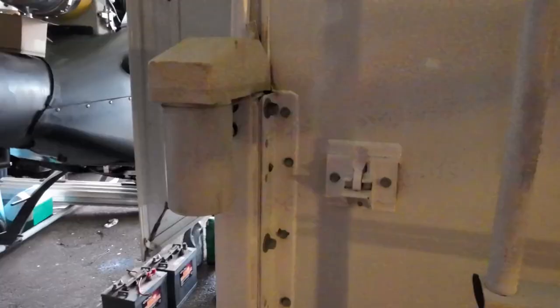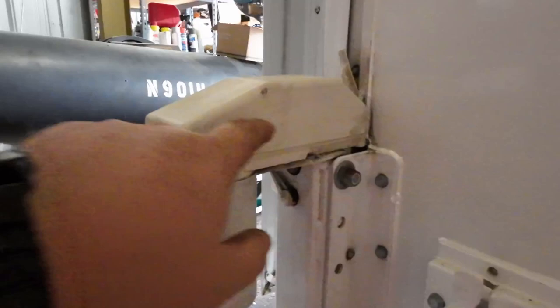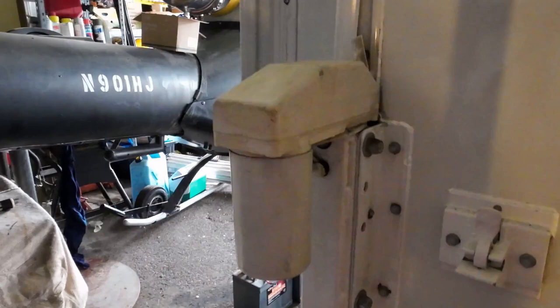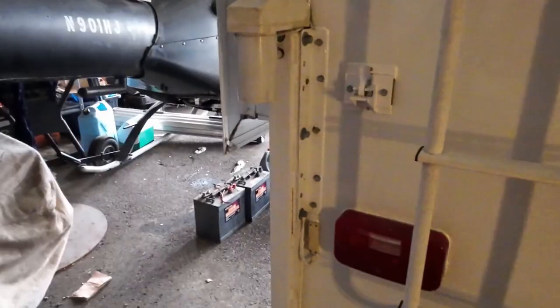I talked to Happy Jack and they think it could be a brass bushing up in here — this motor drives a gear. I'm going to be taking this off. I have some new thrust bearings, some needle thrust bearings, and a washer for in there. We'll see if it's this brass bushing; I don't know what the part number is for that. It may just need to be lubricated. We'll check its clearances and see if it's still good, but let's get this jack off and take it over to the bench.